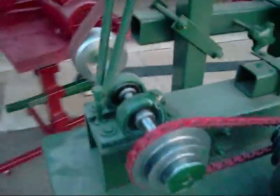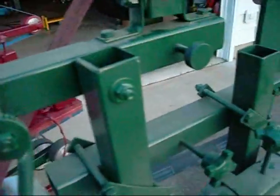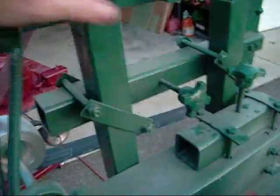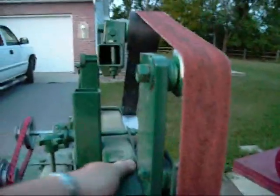Let's go back to the back of the machine. Pretty simple construction again — a common door spring that we use for the tension. You crank that down, and you can see where that pushes — it puts quite a bit of tension on that belt. If not enough, you just pull that arm out and snug it up a little bit more. Basically you loosen this, pull that like that, then tighten it. Of course it's hard to do one-handed, but you get the idea.